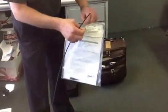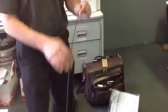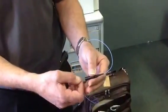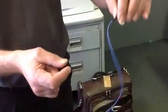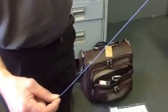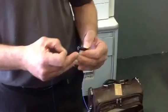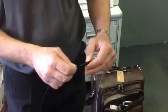All you do is slide your furcation tube on. Grab your furcation tube from the kit — this is the bit that everybody laughs at. Feed the fiber through the furcation tube. Before you do that, one thing I like to recommend: just gently run your fingers over the tube. If you feel any kinks at all, throw it in the bin, because you're not going to be able to get the fiber through a kink.